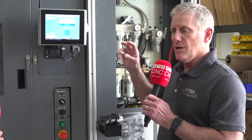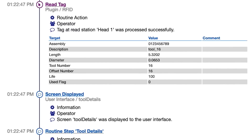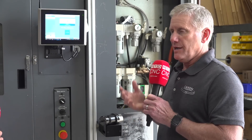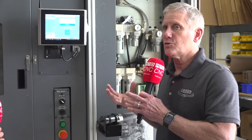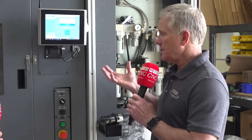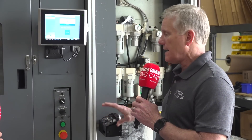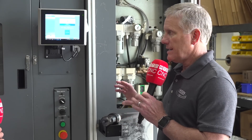The other really meaningful piece of information is that in the background, Tool Connect is creating an audit log of everything that was just done — all the transactions, date and time, what information was exchanged between the RFID tag and the machine control. So if you ever have a problem in production, you can go back and see what the offset length was when that tool went into the machine. You can even incorporate which operator loaded the tool. The system also supports unloading the tool from the machine: any data you'd want to track — such as wear offsets, tool life, or other pertinent information — can be written back to the chip so you may reuse that tool in another machine.